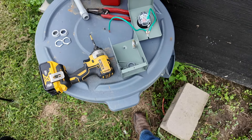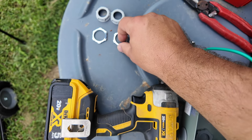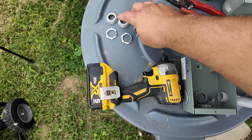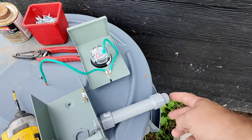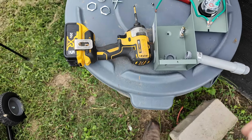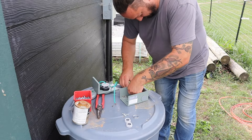Alright, let's get started on the install — I'll explain a little more as we go. So here we've got all of our materials. We've got the assembled conduit that's going to go on there. These lock it down and protect the wire from getting rubbed on that sharp edge — one set for each side. This is actually going to feed into this punch-out. You're going to do the first raised ring punch-out, that's your three-quarter inch. Once you punch that out, it'll fit in. These rings will hold it from the inside. Then we'll go ahead and attach the box and mount it up there and screw it into the well house.